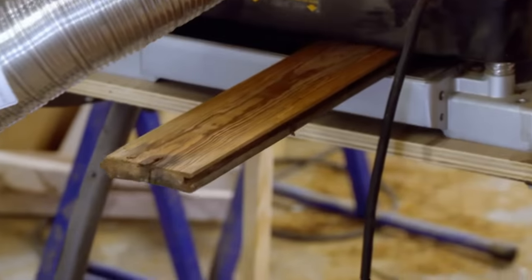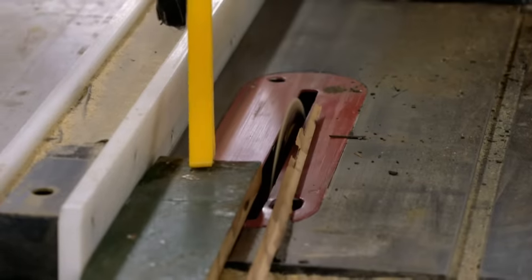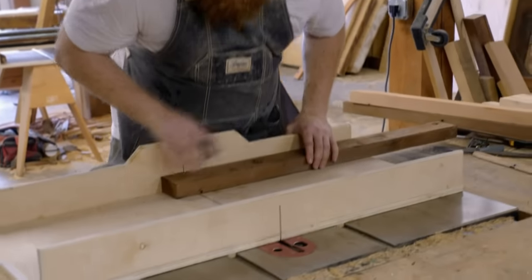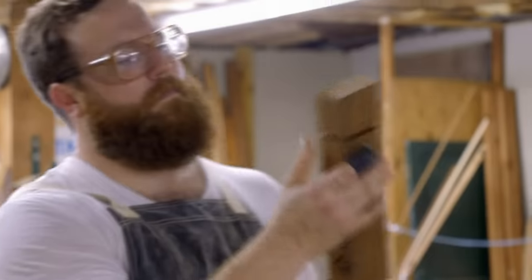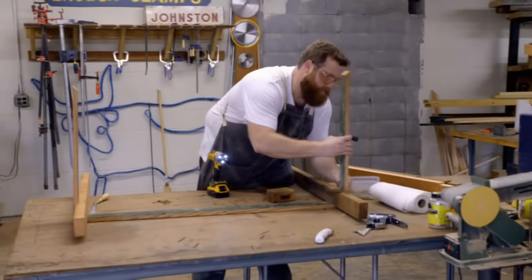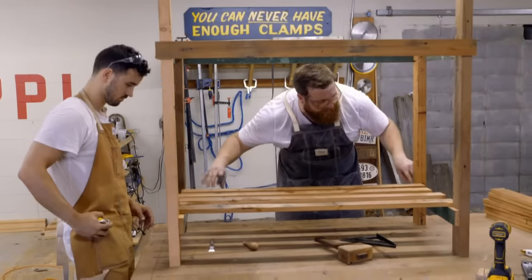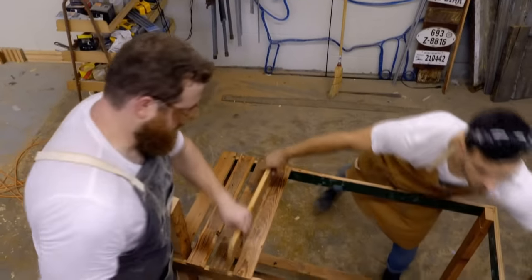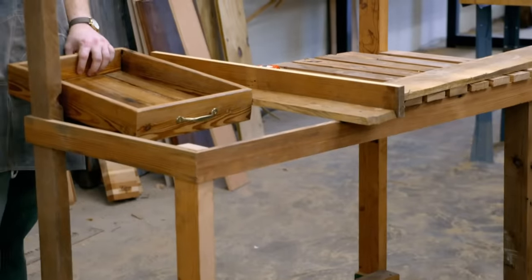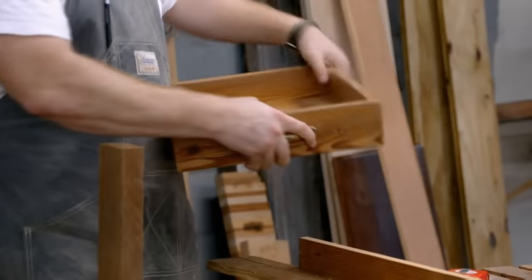We're going to take the flooring and make him a garden bench. We need to get it all planed on both sides, and I'm gonna work ripping some of it on the table saw. We've got cedar two-by-fours for the legs. I'm attaching my rails to the legs, then we'll start putting the slats on — a couple of screws each. A normal garden bench has a slatted area and then it's like a dry sink, a wooden box built into the cabinet.